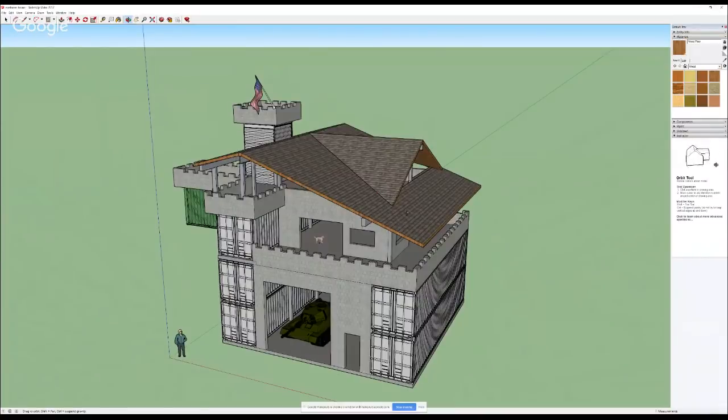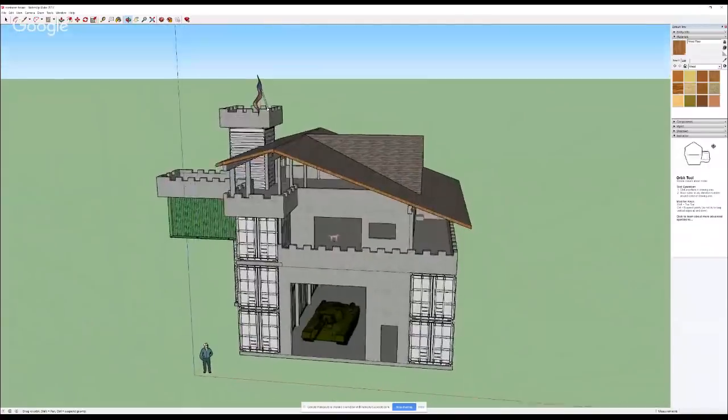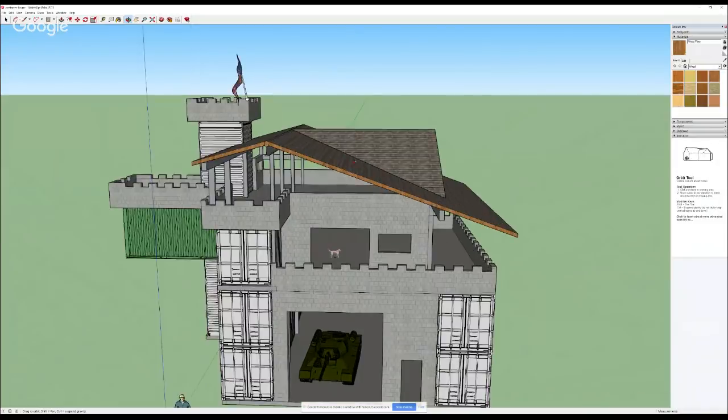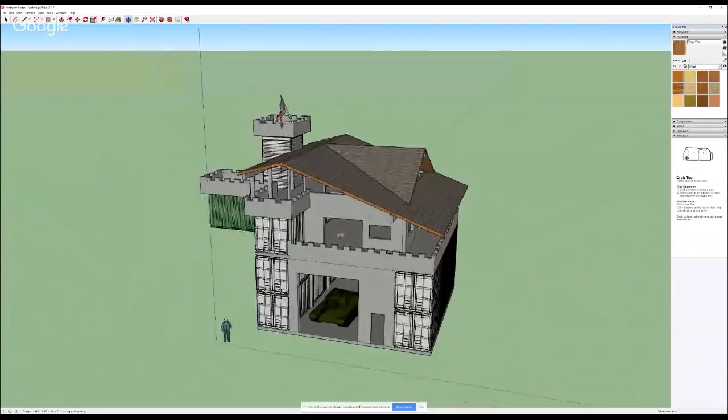And I've got that scissor lift too. I think it needs new batteries, but that'll probably be really handy for this. The scissor lift is nice. I would like a bigger crane, but cranes, you know how much money a real legit crane costs? I mean my crane's pretty legit, but a bigger crane is expensive. No, I'm gonna make it work with that crane. That crane's got 45 feet of reach, and it's a 12-ton crane. But it's 12 tons when you're right next to the crane; the further out you get, the less it can lift. But still, that's quite a bit.